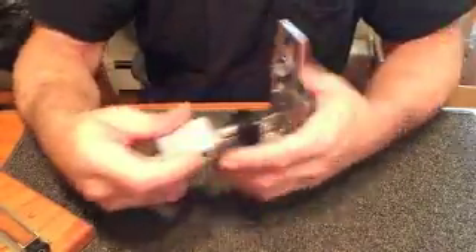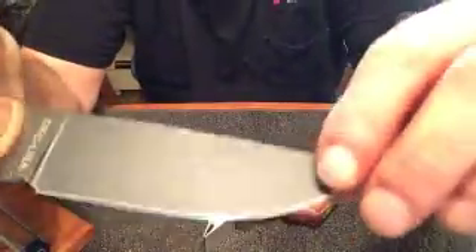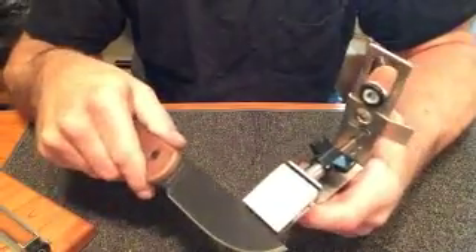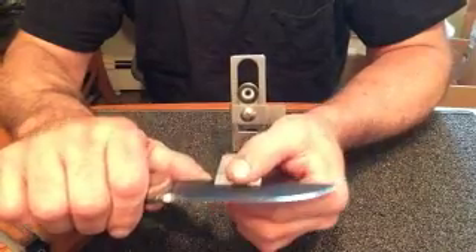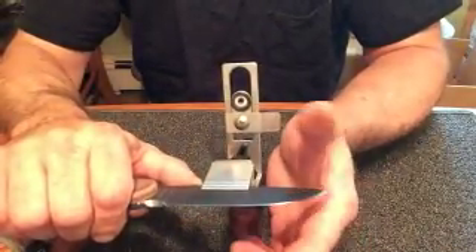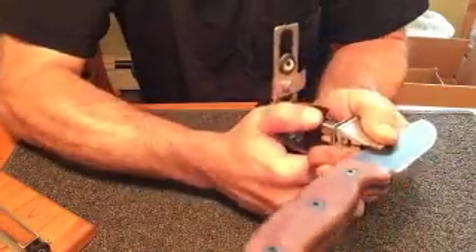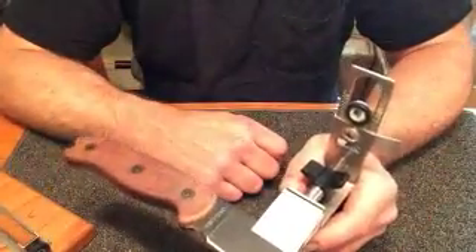Here's an Ontario TAC — this is a full flat, pretty heavy, probably about 3/16ths thick. It works the same. 3/16ths on a full flat is about the max — like I said, all clamps have limits, and on a full flat grind 3/16ths is about the max. It's going to self-center for you. Same thing: line up the spine and the back line, position, pinch, snug, tighten. 3/16ths full flat locked in there, beautiful for sharpening.